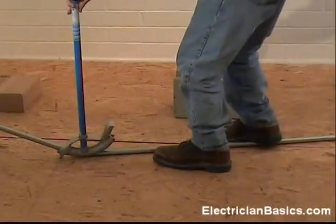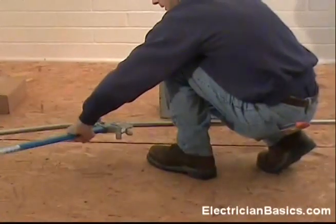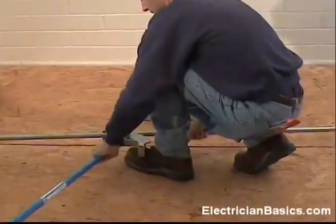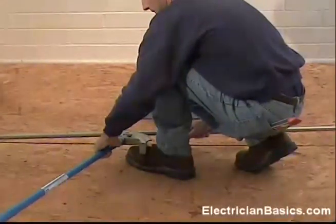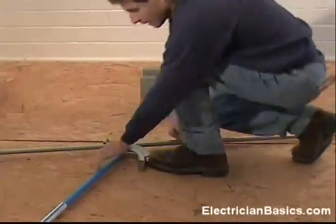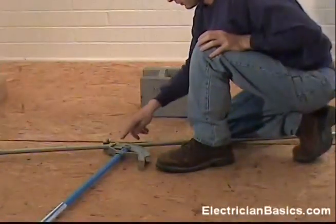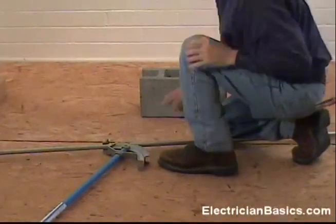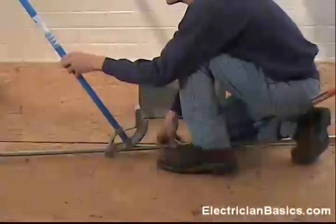Now I'm ready to make my third bend. All I have to do is take that third mark and line it up again with the star. I can see right now here — this is my center mark after we've allowed for the shrinkage. I'm moving to the first mark over here, which is 10 inches away from that, and that's where I put the star. I can leave this one to bend it on the floor.